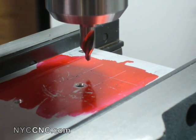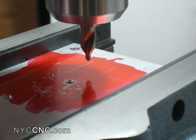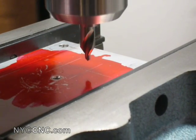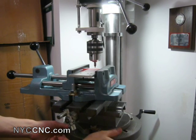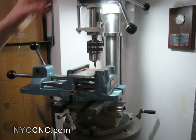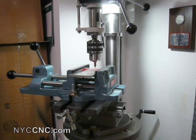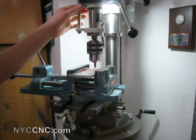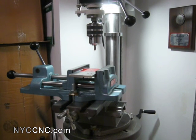The other thing I want to mention is that although the XY table is demarcated on the screws for travel distances, I actually don't use that. For instance, if I wanted to drill another hole one inch over, I wouldn't rely on the marks on the lead screw — I'd just index over and eyeball it. There's a lot of backlash in these and I don't trust them. Most importantly, there simply isn't enough rigidity to rely on it. Even with the piece locked down, there's a fair amount of movement in the table and head, and any time you loosen the table to move it up and down, you're going to really lose a true Z-axis.